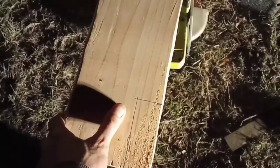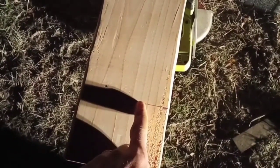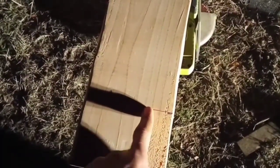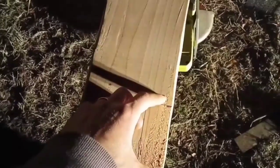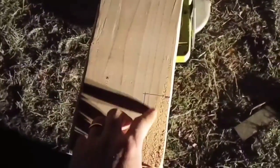We have the walls framed up, and now we're going to cut the ceiling joists that are going to be part of the rafters. We've notched out an inch and a half by three and a half — actually, I just left these at 12 and a half feet. This is actually at 3 and 3 quarters. That's just to save making all the cuts on the end. We're going to notch it out, and that's going to set on top of the top plate.